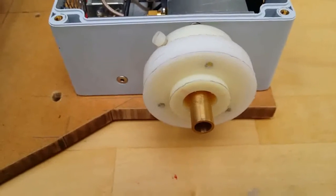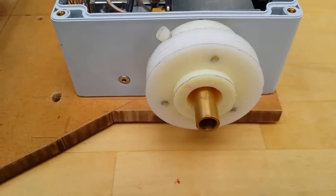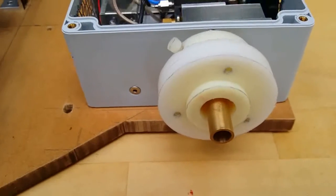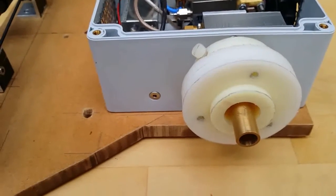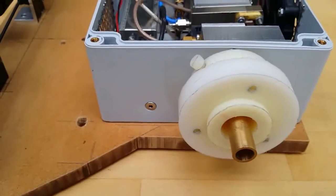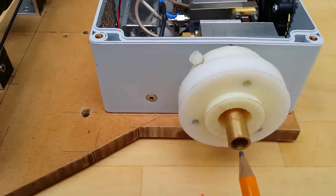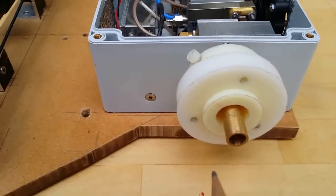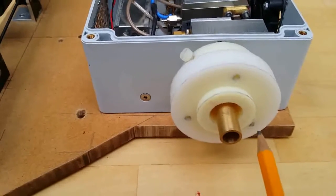Again, the horn on the front is borrowed from the 134 gigahertz system. The waveguide in the diode block is 0.88 millimeters, but the horn attached to it is 1.6 millimeter guide size, which then flares out for the horn, feeding the cassegrain dish, which again fixes via three tapped holes.